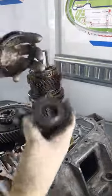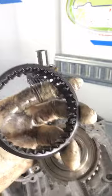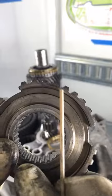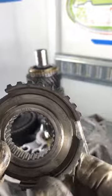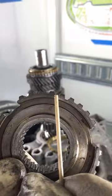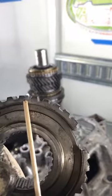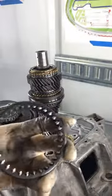Let me explain how the sleeve goes on. The sleeve is really fitted to the hub. The hub has these specific features — right here on every one of these faces, there are two gears that are cut deeper. You can see those two right there. And then as I rotate around, there are two right there that are cut a little deeper, this one and this one, and then again rotating around, this one and this one are deeper. The only way that sleeve will fit in there is if you put it in properly, because these guys have two teeth that are a little bit larger on each one.